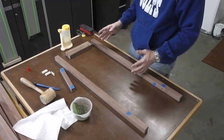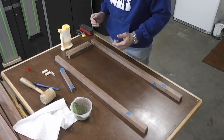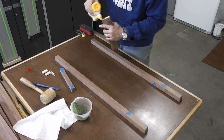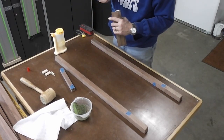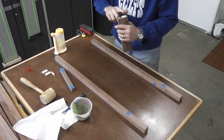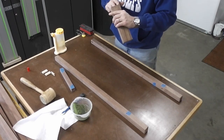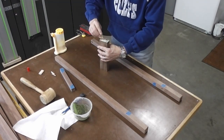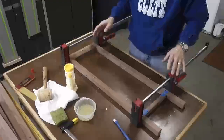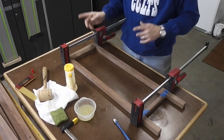I'm getting ready to do the glue-up. I've got one of the sides — I'm going to do the sides first, let those set, and then attach the sides to the two front rails. I need to put some glue on the end of the rails and into the domino hole, make sure that's spread around. I'm not going to put any glue on the legs, just on the ends — with the domino that should be more than enough. After a little bit of fussing I've got it in the clamps, it's nice and square, and I'll set this aside and get started on the other one.